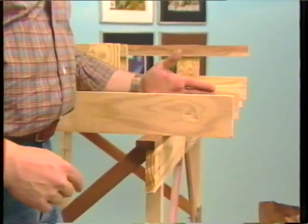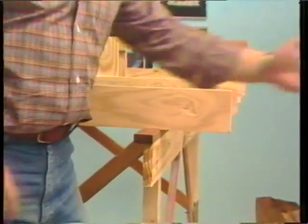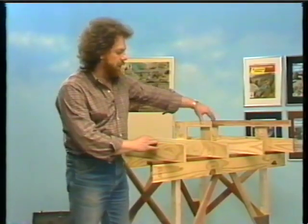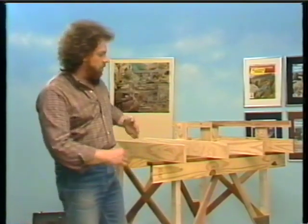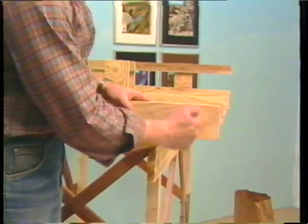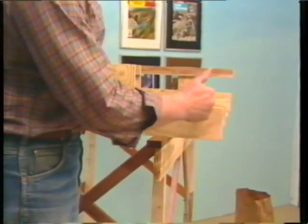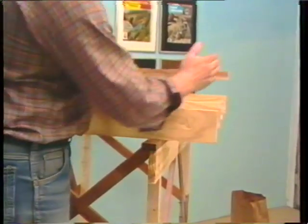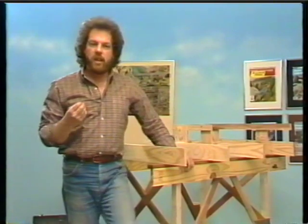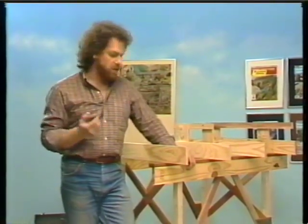And in some cases, like when I'm building L girder down in my train room, they may stick out 2 or 3 feet because I don't worry about it until I have all the track in. And once the track is in, you'll have these sweeping curves and S-curves, and then you can come back and cut these joist members off with a saber saw, and you cut the members off sort of to follow the line of the trackage and the scenery. And that way we can achieve sort of an aesthetic sense to the whole benchwork L girder landscape situation.